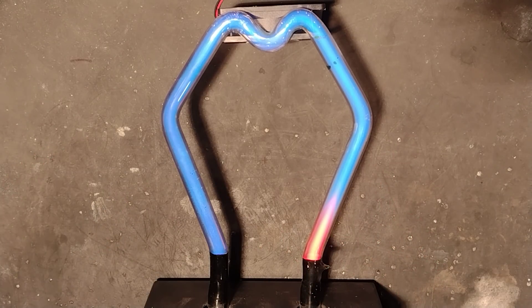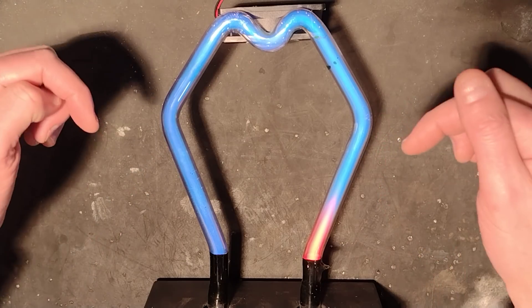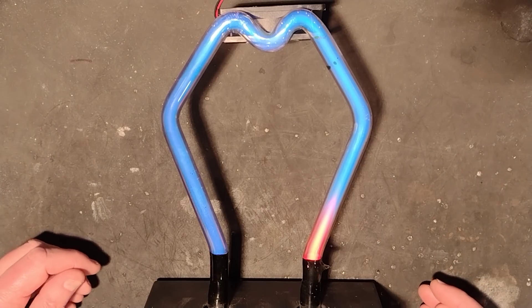That is because it's basically separating the mercury out in the tube with DC — the migration of the mercury. I could give you a long story about how it came about making one of these, but I'm going to put that in the description because you want to see the circuitry, and that's exactly what we're going to do. I'm going to carefully tilt this back because it does operate at 240 volts, which is bumped up rapidly to a much higher voltage.